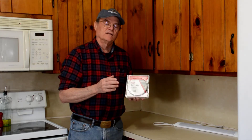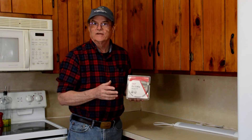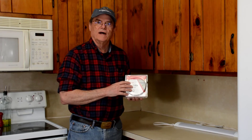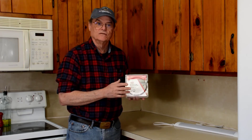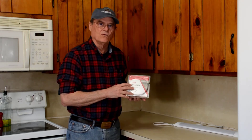This puts out a white light at 4000K. The K rating indicates the color of white light — the lower the number the closer you are to yellow, dimmer softer white. Higher numbers get into what's considered sunlight around 4500 to 5500K, and above that lights start looking more blue. This is 4000K, which should be a good color for our kitchen. Some other tape lights let you vary the K color or choose accent colors, but we just wanted white.